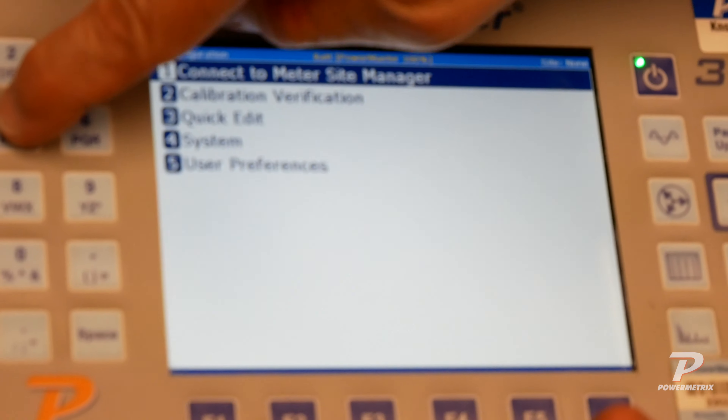Now we can go ahead and start our Powermetrics Remote Manager software. I'm going to double-click on that and you'll see this come up. It always comes up with the orange button first, which is the first thing you should do — it will look for the analyzer. You'll know this is the right analyzer because the serial number on the tag matches the number shown on your screen. We select Connect, and it will confirm that it's connected. You'll notice the rest of the selections are now orange rather than gray, enabling those particular functions.